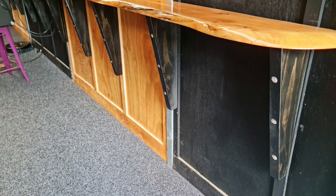Just quickly focusing in on these black supports that sit underneath each of the bar leaners — there are 10 of them in total that we cut on a table saw. They're 200 by 50 mm pine and all the curves were actually sanded to make them look nice. There are three holes drilled in each for the screws, which all needed to be the correct length.